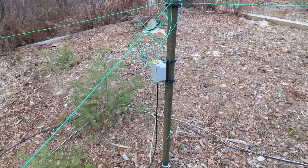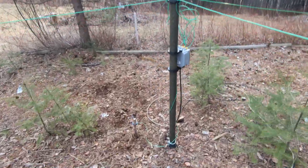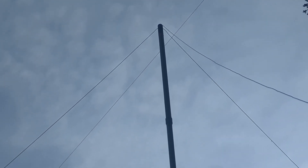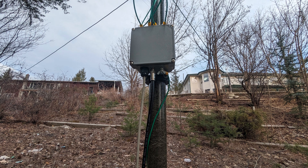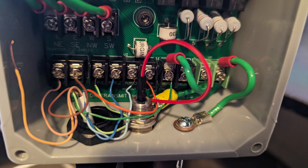Don't worry, I trimmed and cleaned up the wire after taking these photos. Some white pickets from an old rope fence serve as ground anchors and this is where both the loops and the guy ropes are secured. In order to complete the circuit for the loops, a ground rod is pounded into the earth here. This particular rod is just 5 feet of a 10 foot rod as this antenna doesn't really need much more than that and that's what I had on hand. The antenna uses this dedicated earth ground and not the station ground. These relays are using station ground for switching and the coaxial cable is also part of the whole station ground. Since the transformer we talked about before is DC isolating, these two are completely separate grounds. My design did allow for these to be shorted together if that provides better noise isolation, but in my case I haven't needed to test that yet.